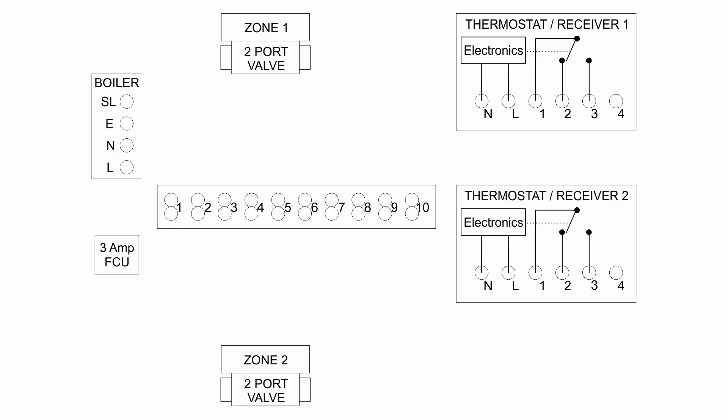There are quite a lot of wires involved here, but we're just going to build this up gradually. It is fairly straightforward if you just do it in stages. To start with we're going to put in a link between some pairs of terminals: between 1 and 2, 3 and 4, and 5 and 6. That's just so we can have more space to put the wires in. So those three links represent the line, neutral, and earth in those three points.